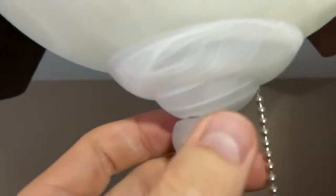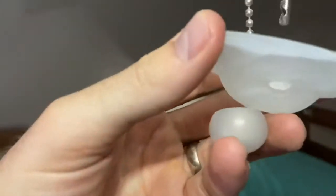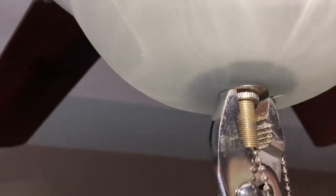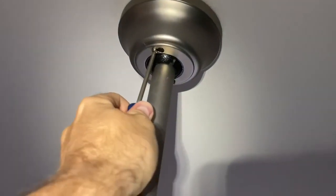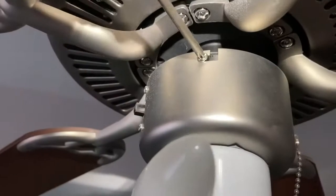Basically what we're going to be doing here is removing this first bit by bit. Now you don't necessarily have to take everything off, but my understanding and my experience here is if you take it off from the base where it actually connects to the ceiling and unwire everything, you're going to be left with a very awkward ceiling fan with not a lot of good places to put it. It'll also be a little heavier and it'll tilt really easily. So what we're going to do is actually take everything off first, including the glass bowl if your fan has one — it's pretty heavy. You just saw me do that, so you can rewind if you need to see how to do that.